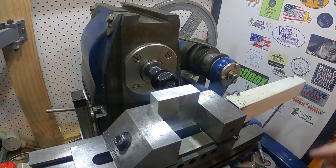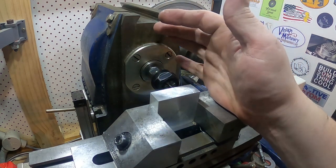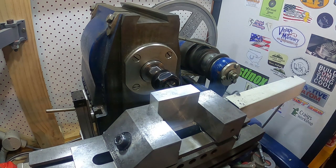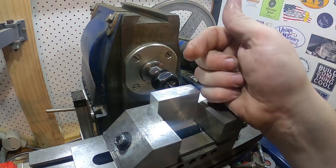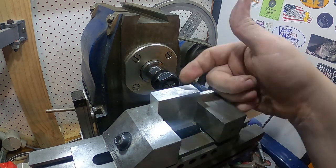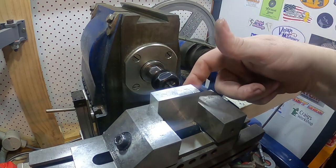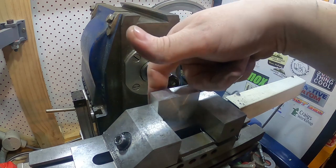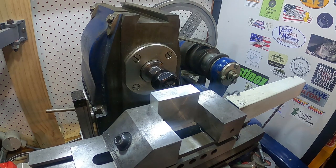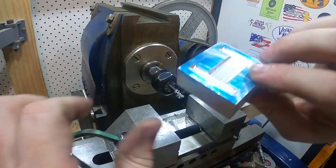So, if all my maths is right, this should be right on the other side. Now, I haven't really shown much of this because there's a bit of concentration required, and also you can't actually see anything on this side. But I've hollowed this out with a 5 millimeter ball end mill in a H pattern, the same as the drawing. And hopefully when we take this out, we'll be able to see what's happened. So there we go.